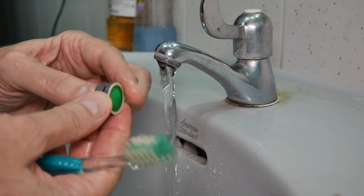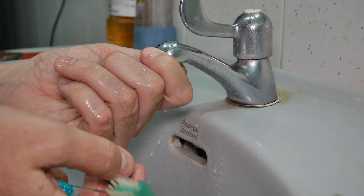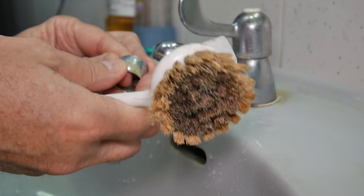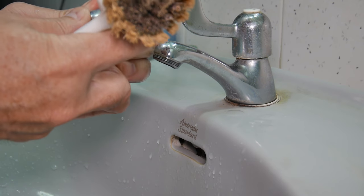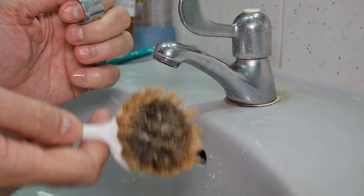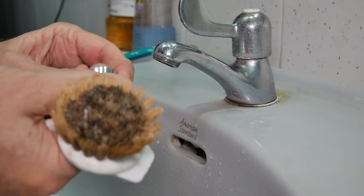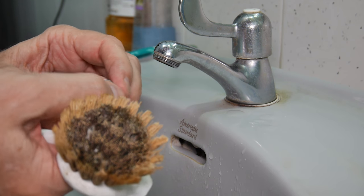They're looking pretty good already. You also want to clean the housing off, and if you have any food-grade plumbing grease, that might be helpful. The safest thing to use for scraping is your fingernails - I use them for scraping paint off wood and cleaning this stuff too. It's not great for your nails, but it's the safest thing. I've also got a brass brush I've been working on this with. Be careful not to remove the chromium plating - if you do, it will corrode much faster and minerals will build up a lot faster.